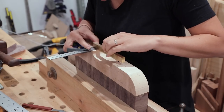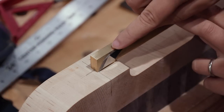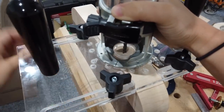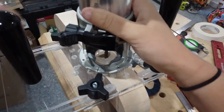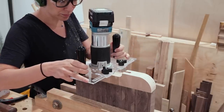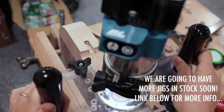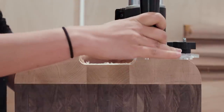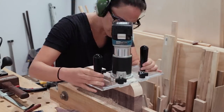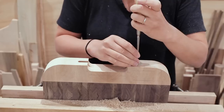For the brass handle I treated it like any other inlay. Making sure it was centered on the board, I used double-sided tape to hold it temporarily while I marked its exact location with a marking knife. Then I used the fences on my six-in-one trim router jig to cut the mortise — line up the edge of the bit with the knife mark, adjust the fence so it touches the edge of the material and lock it in place, repeat for the other fence, then take multiple passes. I kept lowering the bit until I reached the bottom of the notch, then repeated on the other side. Since the router leaves rounded corners and the brass bar is a rectangle, the final step was to mark the ends of the mortises with a marking knife and square them off with a chisel.